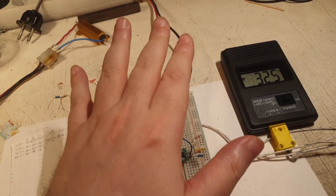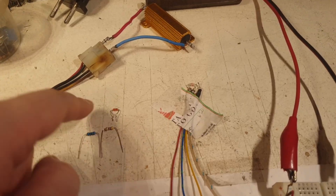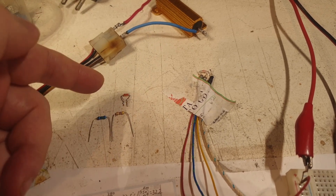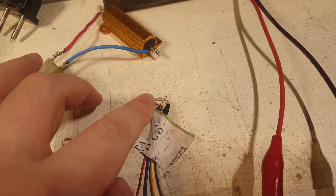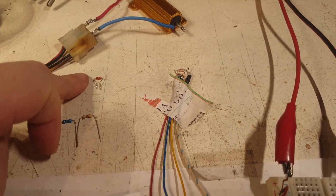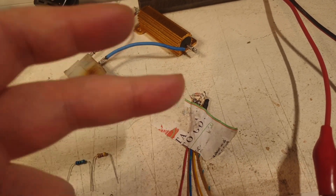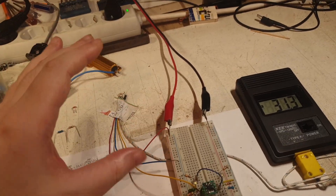One possible cause of the shifting is that this glass element maintains heat for a longer time — or stays cold longer — compared to the bare metal sensor. There is a clear difference between these two probes. The major issue is testing with two different probe types. I tried shaving the glass to get closer to the actual sensor inside, but the result was not satisfactory — the shifting in reading persisted.